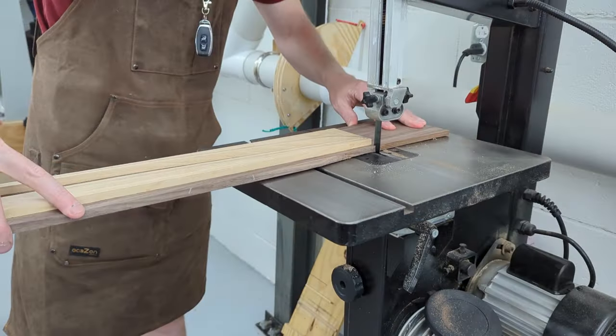To actually make the saya hold the katana, I have to glue on the second piece of walnut. I quickly trace my shape and cut it out on the bandsaw, making sure to stay about an eighth of an inch away from the line this time. This will give me plenty of room for error when gluing it, and I'll easily trim the excess with a flush trim bit later on.